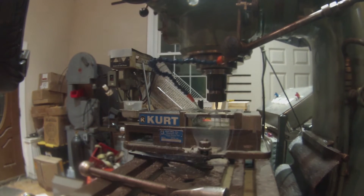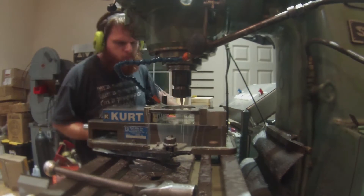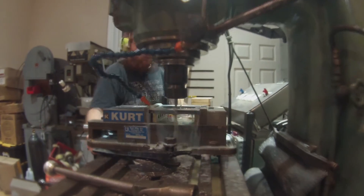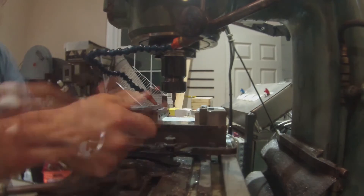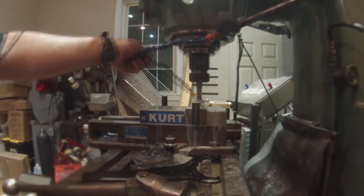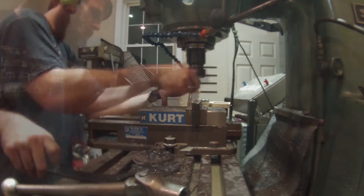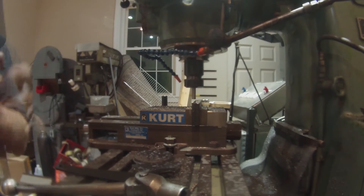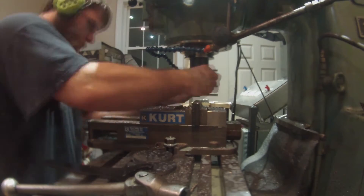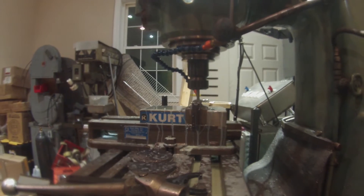Like the first time I did this. When I'm done, I simply snap the steel in half and grind away any excess. I flip the two pieces on edge and plop them into the vise, one in front of the other. Then I put a groove down the center using a 3/8 end mill. The top plate will sit into this groove. I did this because it seemed like it would make it stronger, though I can't explain why.